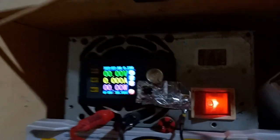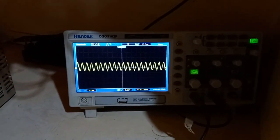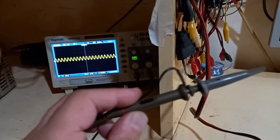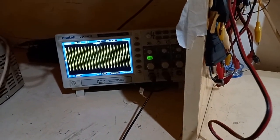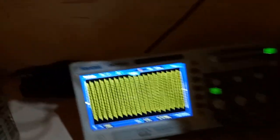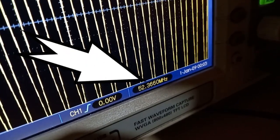Okay, now let's read its frequency. My scope is turned on. Let's give just seven volts on the coil, drawing like 90 milliamps, and it's already picking up the signal. Here's the signal, here's the probe. If I get close to the coil it increases the signal — now it's maxed because it's over the supply wires — and it has a frequency of above 52 MHz.